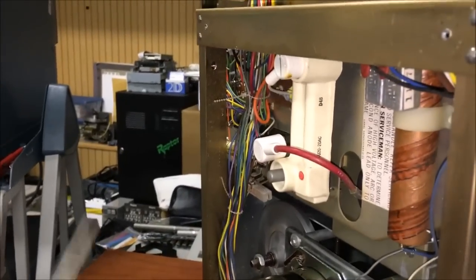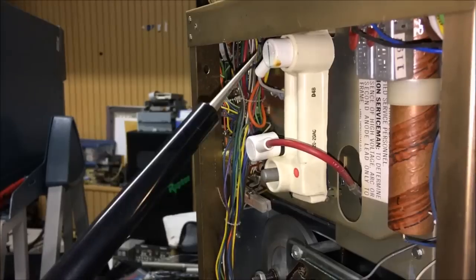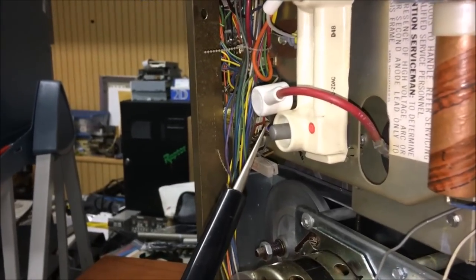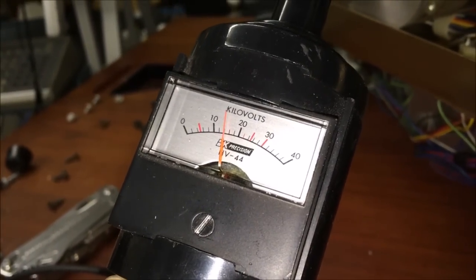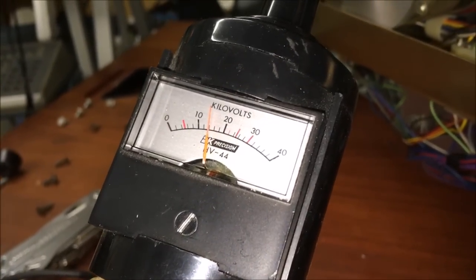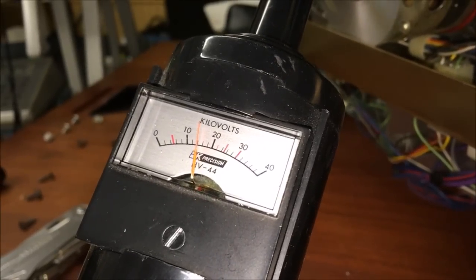We have a new one. The old voltage doubler is now sitting here and Tom has inserted the new doubler. For the time being we have the CRT disconnected - we wanted to verify that the high voltage was not excessive or abnormal coming out of this first. Same flyback transformer feeding the new doubler, and on the output here it definitely still draws an arc, and when we come in contact with it we're reading almost 15,000 volts. That's probably within the actual operating tolerance. We're not over the maximum for the tube, so it shouldn't hurt anything to connect it up.